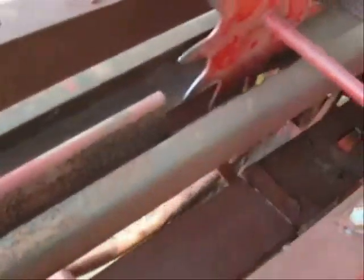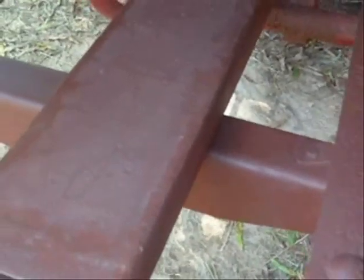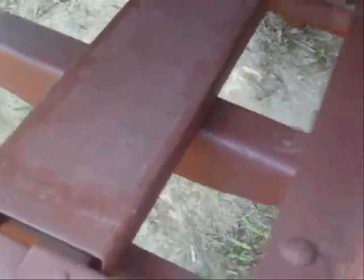I also got this piece put in. This was the bottom piece on the floor. I got my floor part finished and got it primed. It didn't turn out too bad — there's a few little pin holes. That metal was so thin that I did a lot of burning, and on this one there was a little bit of rust-through, so I ended up with it. That's the bottom side. Ended up burning bigger holes than what it had, but this end is in a lot better shape than that piece that was up on top.